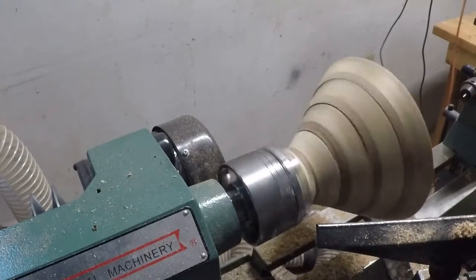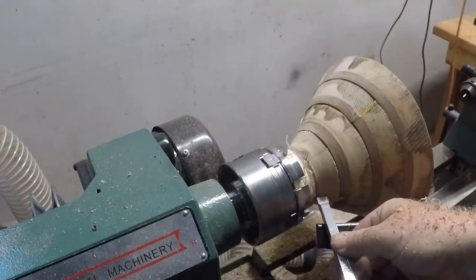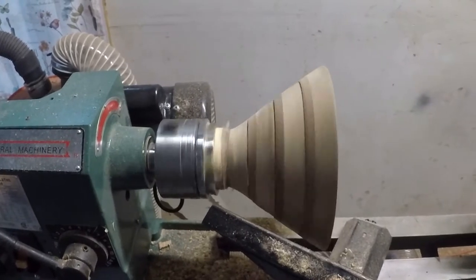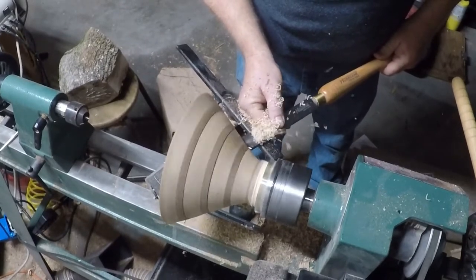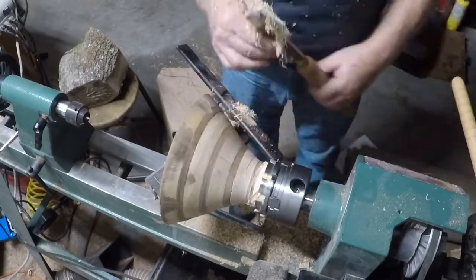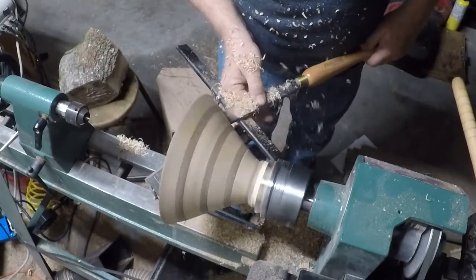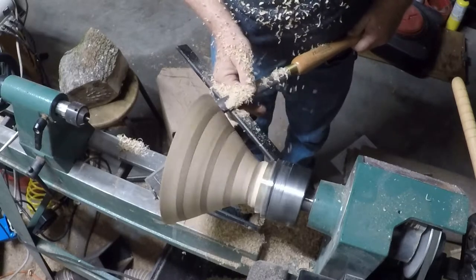But I knew that it was going to be kind of rough and this isn't too bad. So I just started cleaning it up and leveling it up. I knew it was going to be weak at the base, so I figured I would simply turn the base, glue it together since it's a glued-up thing, and be done with it. The black marks you see there are what the bandsaw did when it was at that angle and kind of burning the wood, but it kind of helped in visually seeing what you needed to clean up and where you needed to go a little further down.